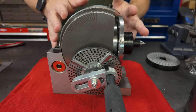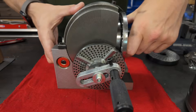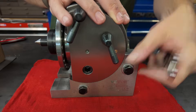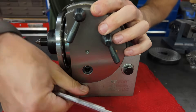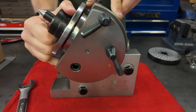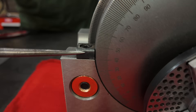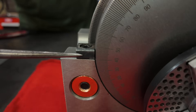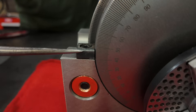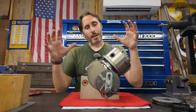There's one more feature to this type of dividing head: the ability to tilt. There's a scale along the side of the unit indicating it can tilt up to 90 degrees. On the other side, there are two locking screws — just loosen those up and you can tilt it to whatever angle you need between zero and 90 degrees. Keep in mind the tilt indicator is just a piece of metal with a tick mark stamped in it, so if you need high accuracy you'll have to dial it in. I recommend marking your own zero reference when you first take it out of the box.